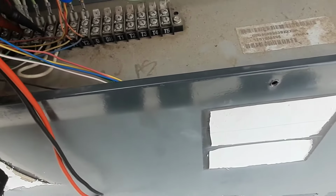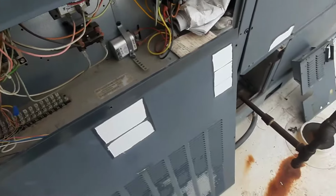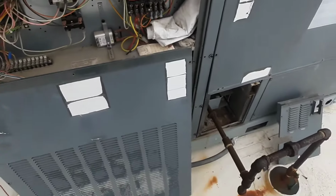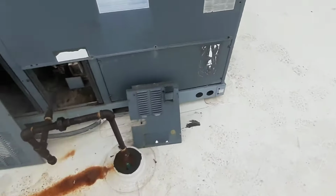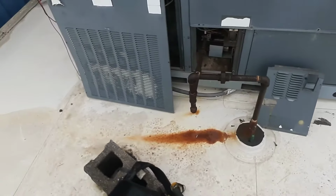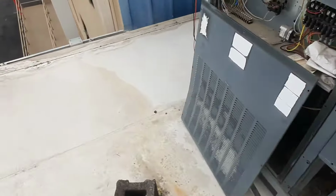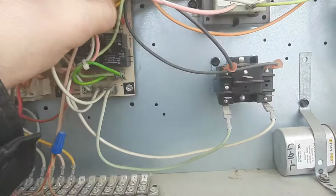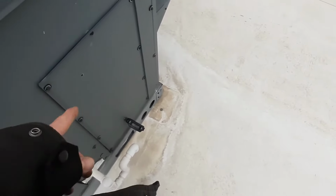That's just weird. So I've either got a thermostat failing or thermostat relay failing, or maybe I didn't have good contact on the pins or something. That's possible. I've talked to the guy. I'm gonna let him know what's going on, and after we get it temporized, we're gonna give him the option to change the thermostat or just wait. I think he's gonna wait and just kind of see what happens. If it does it again, we're gonna have to have a thermostat, because with no lockout on the board, I don't know where else to go. I didn't have a call when I got here. All I did was pull the thermostat off the wall, look at it, inspect it, and then put it back in. So let's get it temporized.